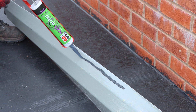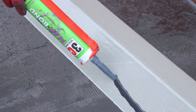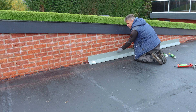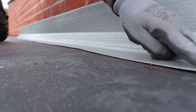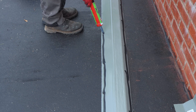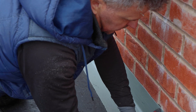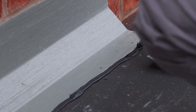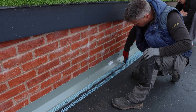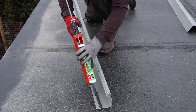The back wall is going to require a fillet strip fixed in place. These can be glued into position using Max Bond, fixed directly to the wall and to the top of the flat roof. Max Bond has great grab properties to a variety of materials, sticking to both the liquid jacket on the roof and masonry brickwork on the wall. Place it straddling the joints by about 200 millimetres, firmly pressing the edge of the fillet strip tight against the wall and onto the roof. Then apply a little more Max Bond across the joining edge and roll out reinforced tape, spreading it with a plastic scraper.